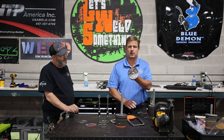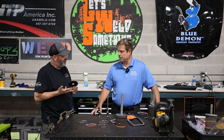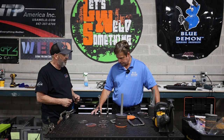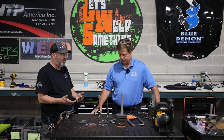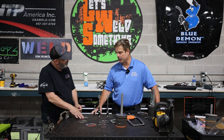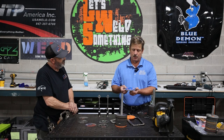Talking about applications and longevity — I don't load up a disc with hard pressure, and I don't like running at maximum RPM. I like to feel where it's working and use that RPM, which is way lower than most standard grinders. You plug in a DeWalt, Metabo, or whatever — they're triggered at one speed, about 11,000 RPM. Do you recommend variable speed for grinding tools? Not so much for cutoff wheels, but more for coated abrasives like flap discs or combo discs — you want a lower RPM to let the tool do the work.